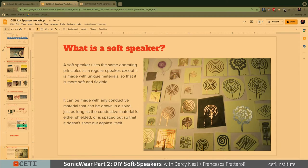If you wanted to get really crafty, you could also do the cone, have it on a cylinder and wrap the wire around that, but you could also do it flat. They usually do it wrapped around a cylinder in these speakers because then it's more efficient, because you're getting it as close to the magnet that's inside of here as possible within that magnetic field without actually touching it. So, yeah, but we can do it in whatever way we want.